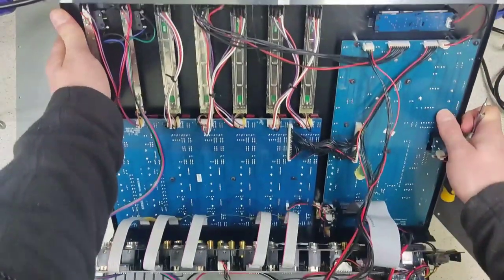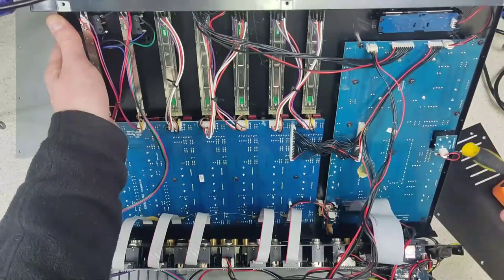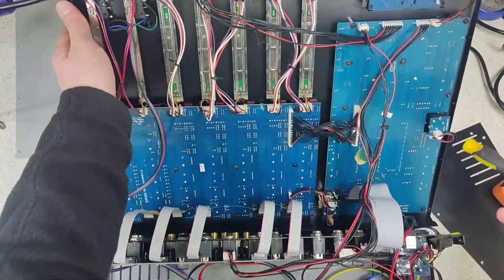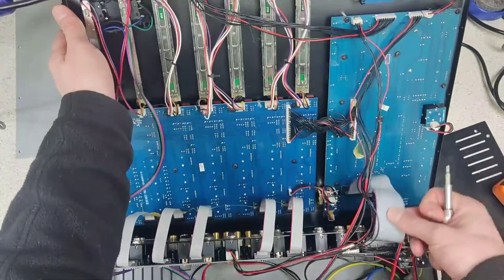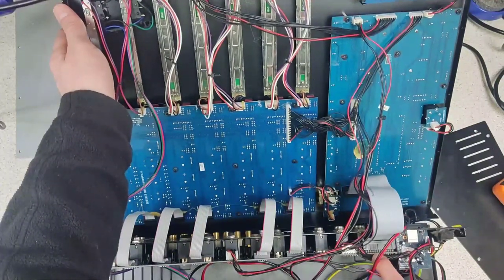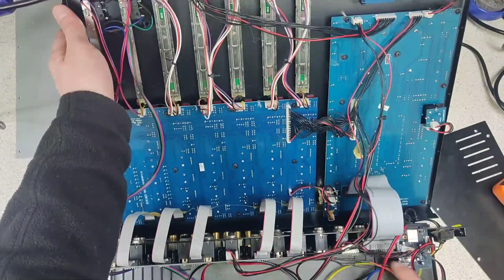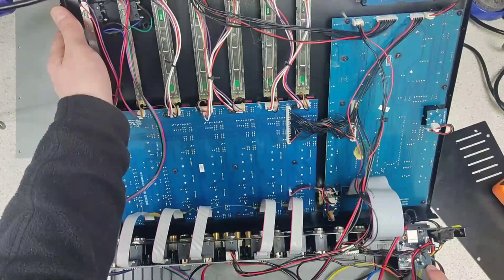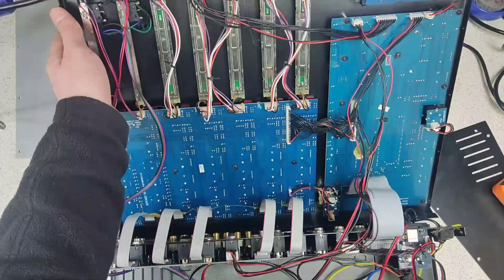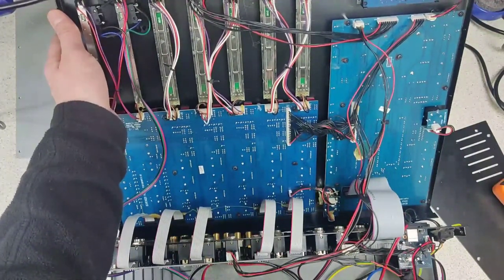This tiny little board up there is your crossfader — it's an optical crossfader. This board here is your headphone out. This cable here is the troublesome ribbon cable that I previously showed you how to fix — I've completely replaced mine and had to put a new set of headers in to do that, which cured the missing right channel problem I had. And finally this little board here is your USB input board, which comes in as one of your optional inputs on channel three.